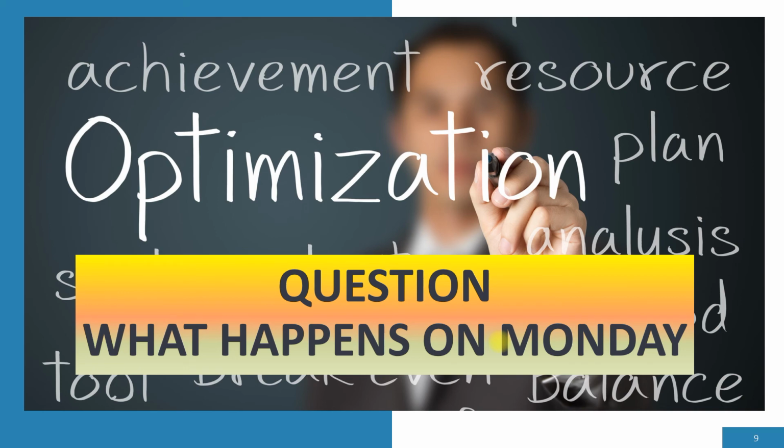So my question is, what happens on Monday? Monday, we don't accept Waterhammer anymore. There's a reason for it. We have to find the reason and implement a solution or correction. So don't think of Waterhammer as normal. It is abnormal.